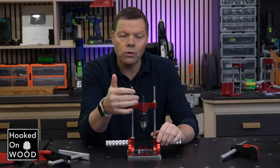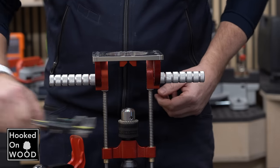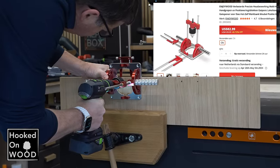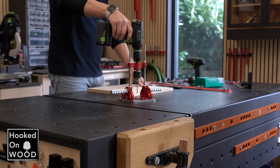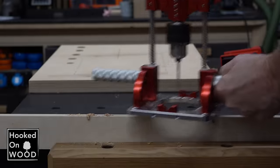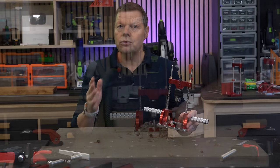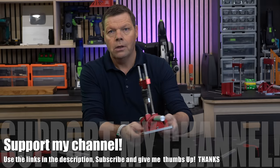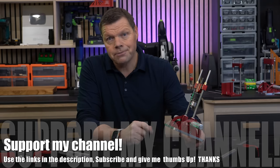This bridge has some screws that also secure the bearing, and I do not know why they chose this option, but it is important that you only tighten them slightly. In the end, it is a very nice-looking drill guide that is well packed, and based on its appearance, I found the price pretty attractive for what you get. It is a bigger drill guide, but I like that — it just makes it more stable, and you can place it on your workbench with your drilling machine attached to it without it falling over. It is evident that it is not as stable as a drill press with such a mobile and lightweight design, so it will all have some flex. But the more important question is: are you able, with some care and focus, to drill nice, straight, angled, and consistent holes with this drill guide? And I think that is very well possible. Its broader base makes it perfectly stable, and the fit and finish, to be honest, is very impressive at this price point. This is my scoring card.